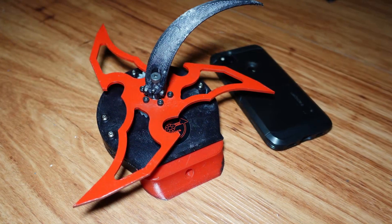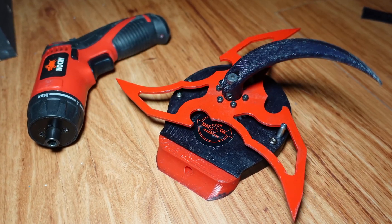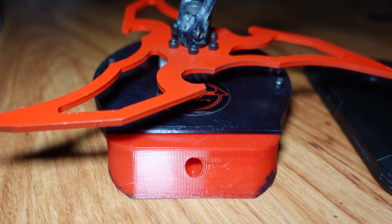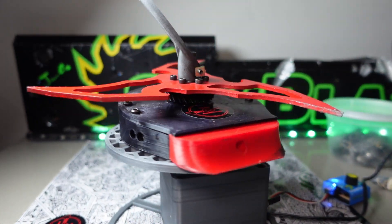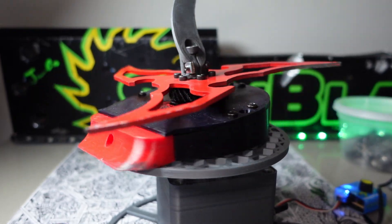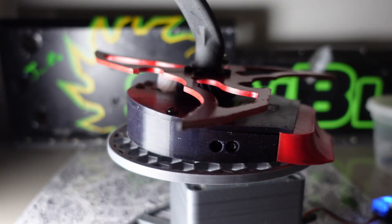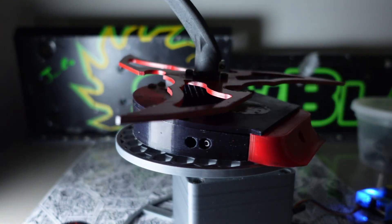In order to make the self-righting work a lot better, I decided to change from attempting to use set screws threaded into plastic — because that doesn't work at all — to instead trying to make a clamp collar style system. At first I tried using a lock nut with a number 6-32 screw. That turned out terribly, because the lock nut required way too much torque to screw into, so it just spun and deformed the plastic hex imprint. So then I switched to using a square nut that doesn't have a nylock insert, and that seems to work very well, because I can torque it down as much as I want. It just pulls the head of the screw and the nut together with more and more force, and I can tighten it really, really tight onto the shaft to the point where it doesn't slip very much anymore.